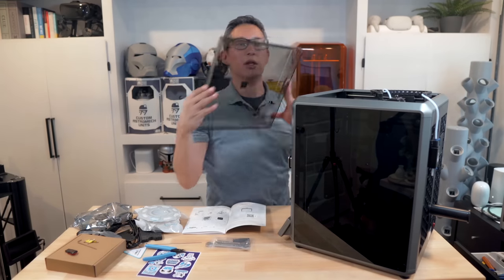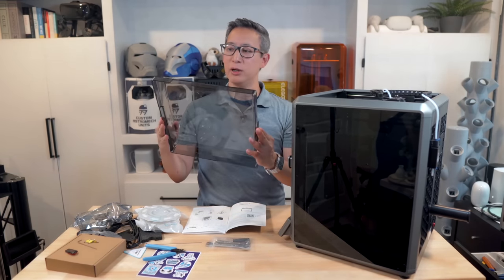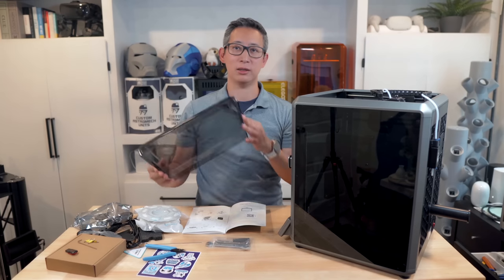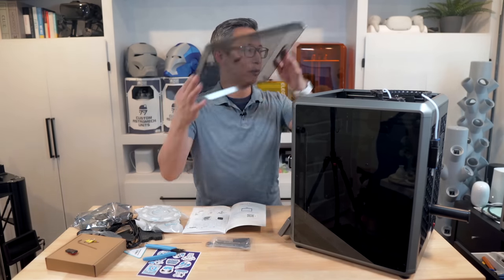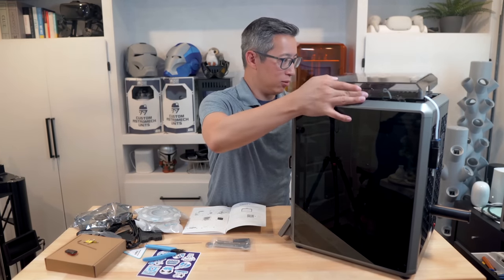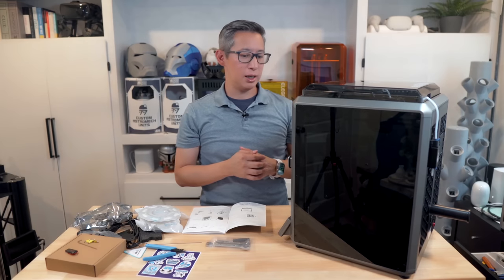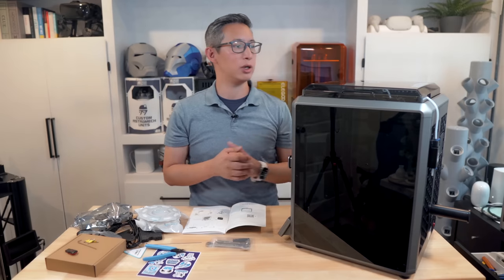But what it does say for the lid is, when printing low temperature filaments such as PLA and flexible filaments, remove this clear top cover. You're supposed to use this cover when printing high melting point filaments such as non-PLA and non-flexible filaments. So the roof is optional depending on the material you are printing with and the temperatures at which you're printing. But for me right now, it's not aligning very well. So let me know if you have the same experience with your Speedy, and if you were able to figure out how to get this on, what your solution was.